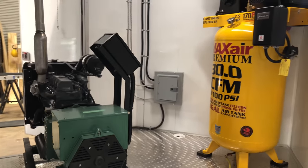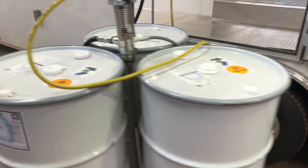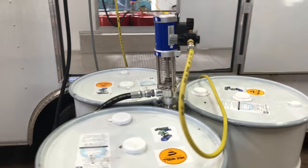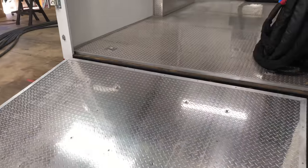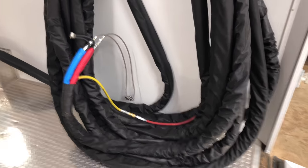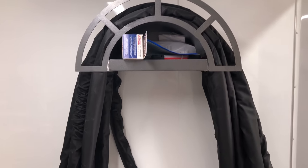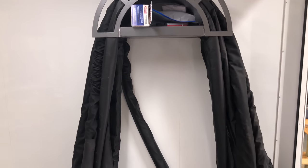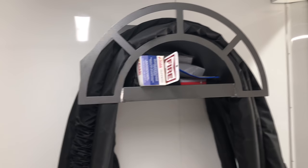A little bit noisy in there — we're going to go ahead and pull on out of here. Let's get on back to the back of the trailer. Again, you can pump from the outside of the trailer. If you have a big job, just bring it up on a pallet. Here's your machine. Nice ramp on the back to load material. Come on up inside here — first thing you'll see, we've got 150 feet of hose. We manufacture this hose. We use 3350 PSI high pressure core, then we scuff it with a Velcro scuff jacket. It has all the fittings, it's color-coded, ready to go. Nice professionally manufactured hose rack holds your hose.